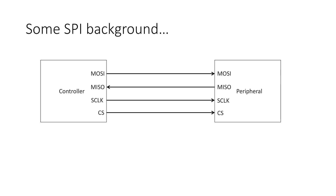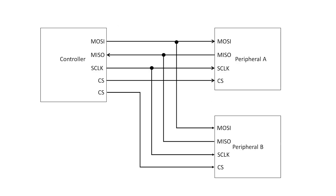The master and slave terminology is being phased out, so in this video I'll use controller and peripheral instead. In most cases pull-up resistors are not required with SPI, unlike I2C. You can chain multiple devices along the MISO, MOSI, and clock lines, but you will require a separate chip select wire for each peripheral device. There is no hard limit on the number of devices as with I2C, which has a finite number of addresses. In practice, the most limiting factor will be the GPIO pins available to act as chip select pins.